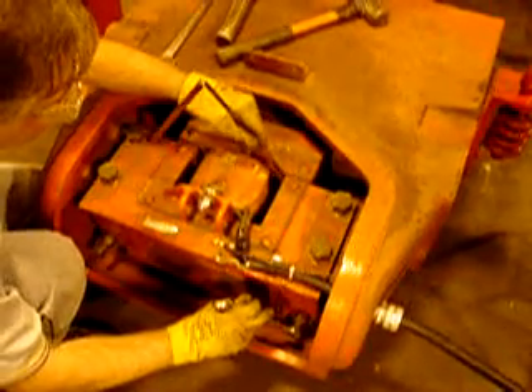Notice how, when he turns the jack screw inward clockwise, the feeler gauge is tight and then it will loosen up. Notice how it goes in. Once the desired gap is achieved, go back and forth and make sure it is even on both sides.